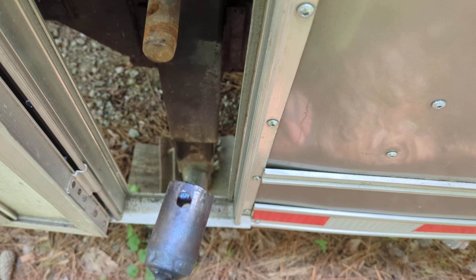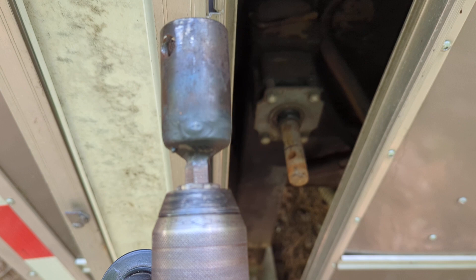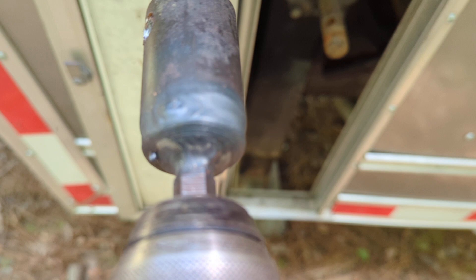Pick this up, pull that pin out, that cup slides out — does the shank of a hole saw. A slug that I made to fit into the pipe and for the shank to slide through, then I'll weld it together. Then a hole drilled through for the pin. How fucking neat is that? Works beautifully.